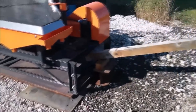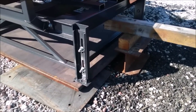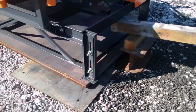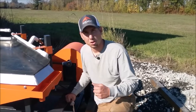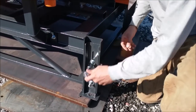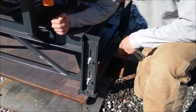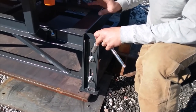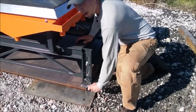The easiest way to adjust the shaker table: loosen the nuts on the legs on the sides you want to adjust, get a fulcrum and a lever. It's easiest done with two people — one person presses down on the lever while the other watches the level on the shaker table. When the legs are loose they stay flat on the ground. When the level shows level, they tell the person to stop, and the nuts can be tightened back up to hold the shaker table in place. When adjusting, I like to only tighten the top nut first so you can easily readjust each leg if needed. When it's all level, come back and tighten down the bottom nut to lock the shaker table in place.